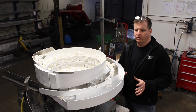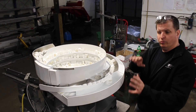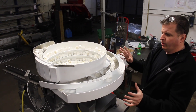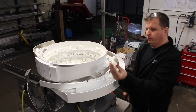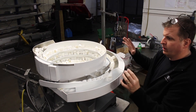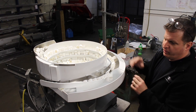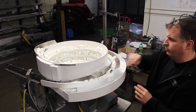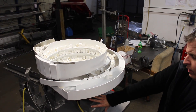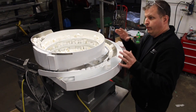On this particular feeder, we're looking at a complete stainless steel FDA application with Surlyn coating. Every bowl is different — every one has a different application. This one's feeding a cap made for an FDA application. Surlyn coating is kind of like a golf ball coating; it coats the whole bowl and seals all the cracks. It's FDA approved — it's a DuPont application. This particular feeder has a stainless steel base, nickel plated drive, and variable frequency controls.